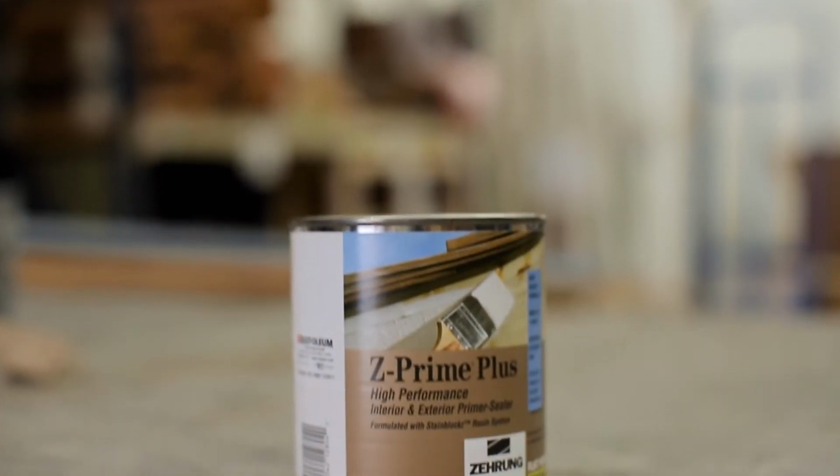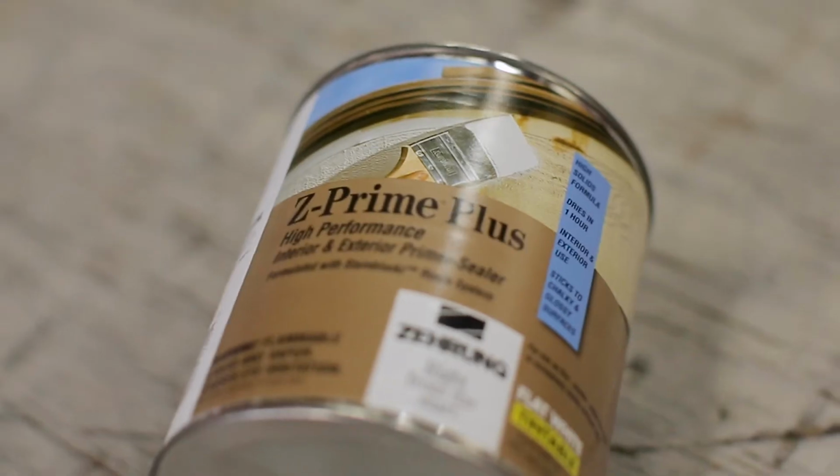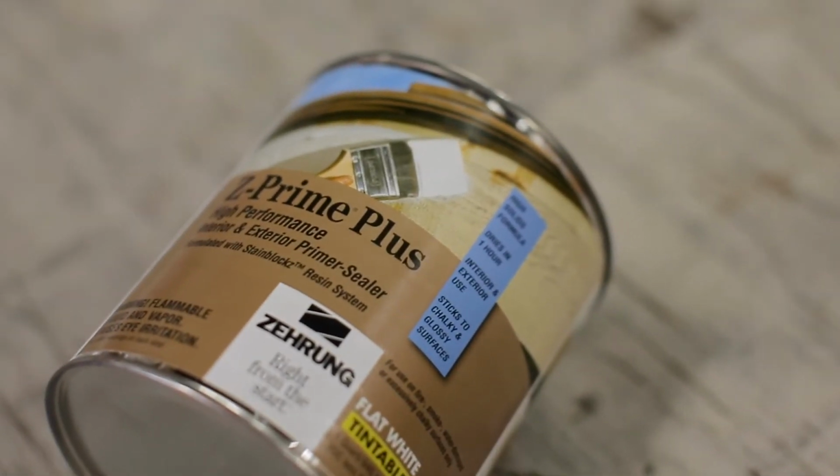When it comes to solid body finishes, paints and solid stain for siding and trim boards, we recommend, if available, an alkyd oil stain blocking primer. It's a proven product. It's absorbed by the wood, and it creates a great base for the top coat of either solid stain or paint to adhere to. We recommend 100% acrylic latex top coats over an alkyd oil stain blocking primer.